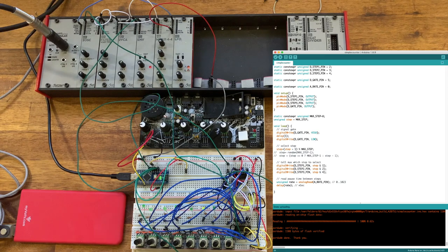And also let's think about what we've achieved here. The first thing is we are seeing that we are getting analog inputs here. So we could use additional potentiometers, so not just controlling, for example, the rate, but we could use another potentiometer to select the number of steps that we're using. There is also the ability to do a digital read off these digital pins, so we could use buttons, for example, to toggle between the step sequence's direction. So this is a very flexible way to build a step sequencer.